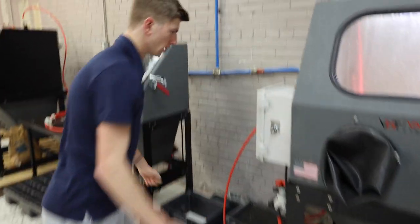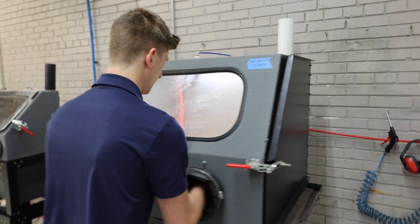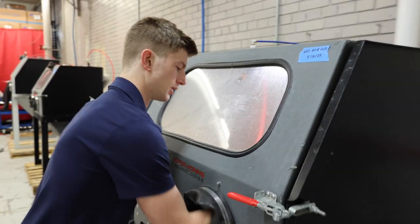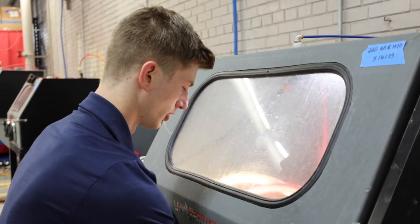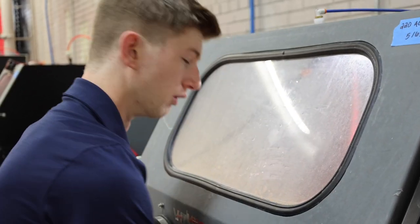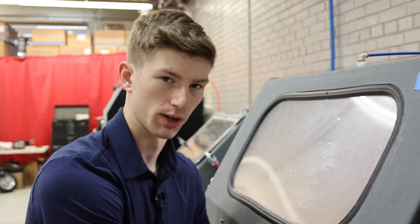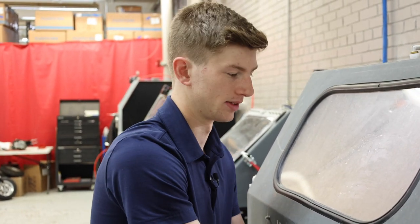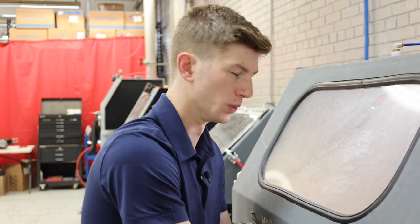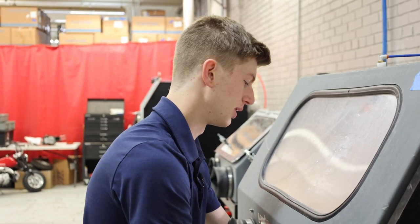We're starting at around 110 PSI, which will probably drop to around 100 working PSI. It's usually a good idea to blast at higher pressure when you're trying to remove paint, although your abrasive choice is more important than the pressure. Something like silicon carbide is gonna rip no matter what pressure, and something like glass bead really shouldn't be used to try and strip coatings or paint.